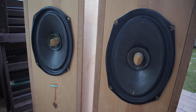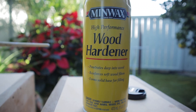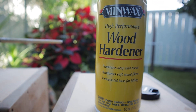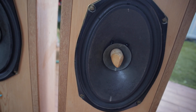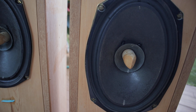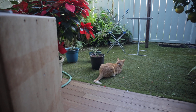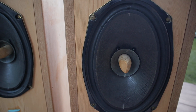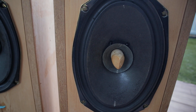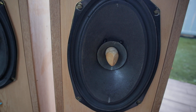You can rejuvenate them and make them look like these — now nice jet black and a little bit moist. That's because I applied a layer of wood hardener on them. This is Minwax wood hardener. There are several different things you can put on a driver; for example, Damar would be maybe a better choice, however for me it wouldn't be, because here we have tremendously high UV and Damar is not UV stable. Even through my heavy tinted windows, the Damar on the driver cones gets too much UV damage.